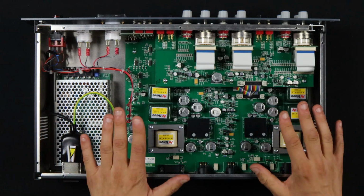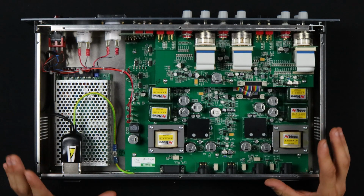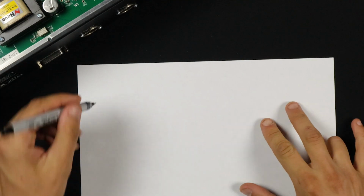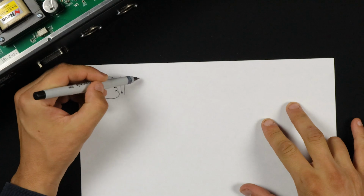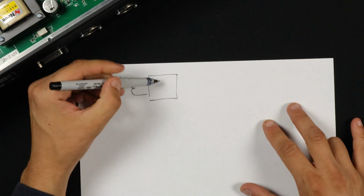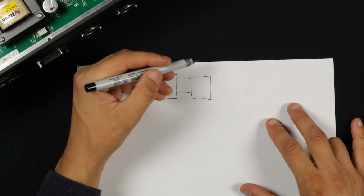Anyhow, that's enough about the signal path. Let's talk about this compressor as a compressor and just how unique and interesting it is. And to do that, I'm going to switch over to a block diagram. So as with most vintage gear, we're going to come in with a transformer for our balanced input. But unlike most gear, we're going to stay balanced and go into the gain reduction section fully balanced, which is an interesting fact about this piece.